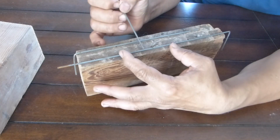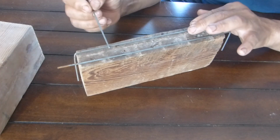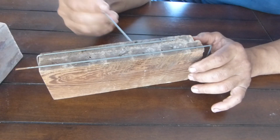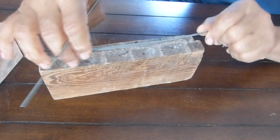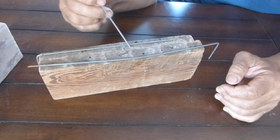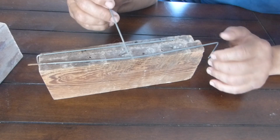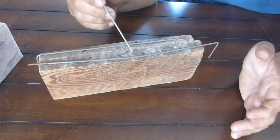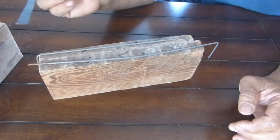So when you get deflection of this deck. This may be more rigid up here at the critical shear heads because it's 5/8 steel sticking out, transitioning over to number 4 steel, I think in the top there too, and you get this deflection of the deck. I'm taking a little liberty there, and you get some rigidity here. This deflection creates a bond break that's cycling over and over again. Then you get a core sample in there, and you see where it looks like teeth been grinding. Well, the bond break is taking place. It never took place properly. Remember, I talked about another one where the formwork is the problem during the build.